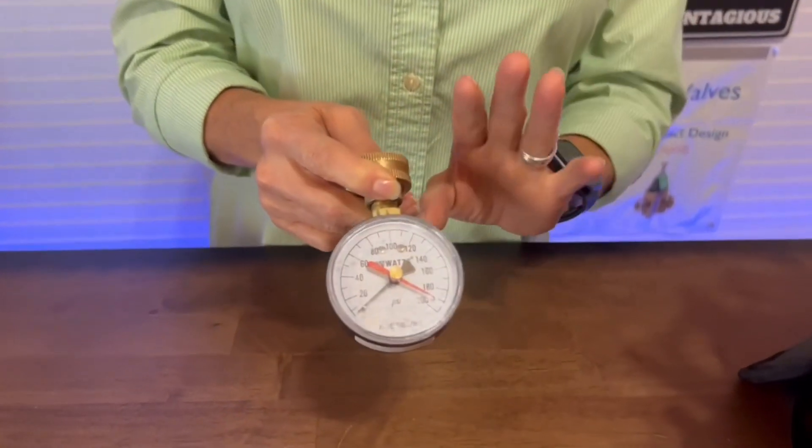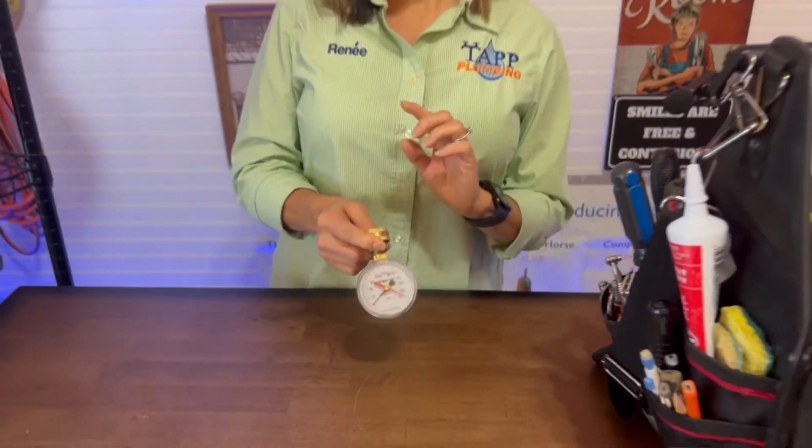I am so passionate about people checking their water pressure. It is really important that you have a pressure gauge inside your tool bag. Your pressure should be between 50 and 80 PSI. It's really easy to check — just go outside and screw it onto your outside spigot. If it's over 80 PSI, your pressure reducing valve is not working properly. I like to tell people: if you have high blood pressure, you have a stroke; if you have high water pressure, it's possible you could have a flood. At the very least you're going to have a running toilet or dripping faucets. So keep a pressure gauge in your tool bag.